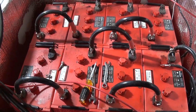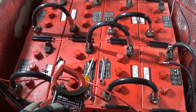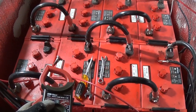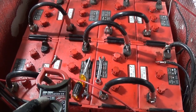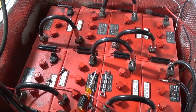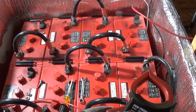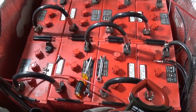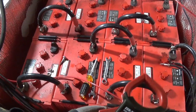I'm trying to save money to get lithiums — that was the goal anyway, since technology is so much better now than it was ten years ago. Inverters, everything. The game plan was to eventually upgrade these, and now it's going to be sooner rather than later. Here's what I'm doing: I'm going to totally disconnect those four dead batteries, which I've already done. Instead of the original main positive and negative, I'm going to use just these four good batteries — new main negative here and new main positive here.